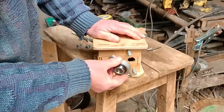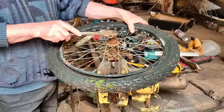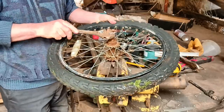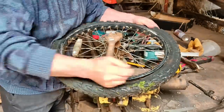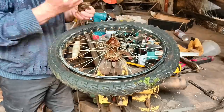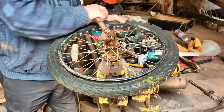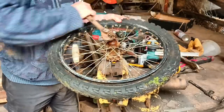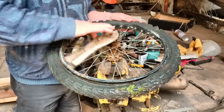I've spent a long time thinking about wheels — what sort, how big, how to use them. A few people have said ordinary bike wheels just wouldn't be strong enough, but they are used on trikes so I'm not convinced. One thing's for sure though: normal bike wheels are designed to be supported on both sides of the axle. If I tried to fix the wheel on just one side, the spindle inside would just bend because it's just not strong enough. This fact has been the bane of many a young inventor for decades.